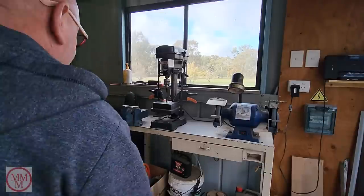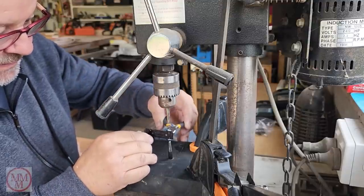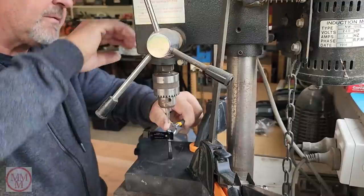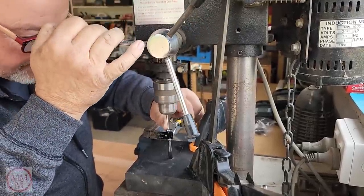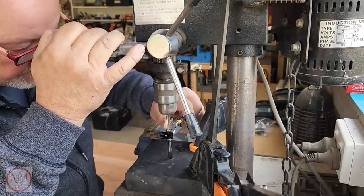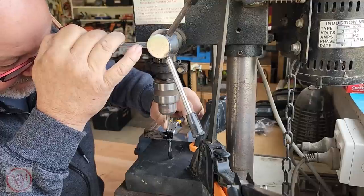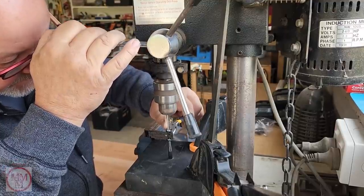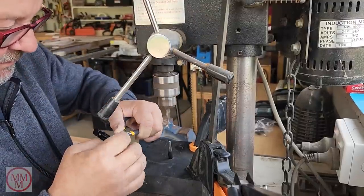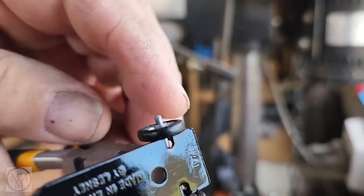So into the shed, and I've got to put these wheels on. I hold the axle with some small pliers to prevent the axle from spinning, and then I use these two little nail punches in my drill press. It's funny, I have to consciously hold that axle with my left hand. In the past, because I'm concentrating on the pressure with my right hand, my brain switches off and I've let go. So I've learned to sort of split my brain there and do two things at once: hold the axle and pull on the drill press.